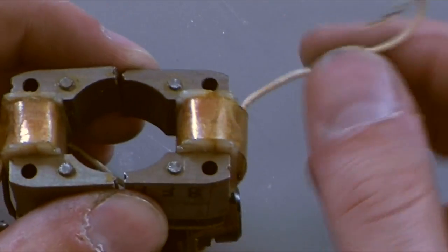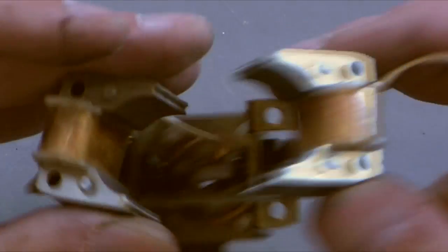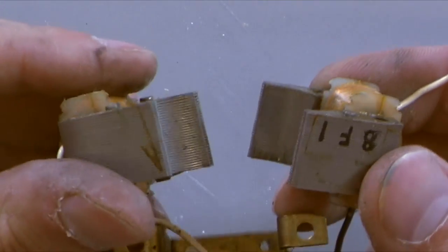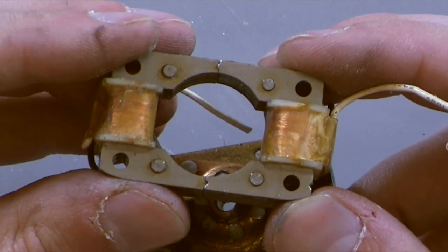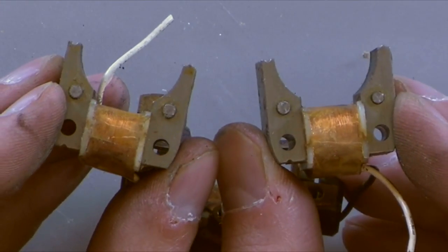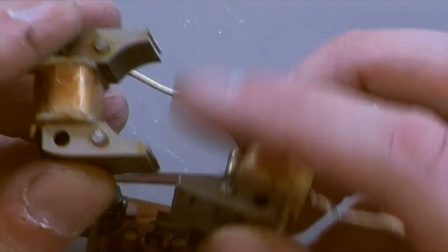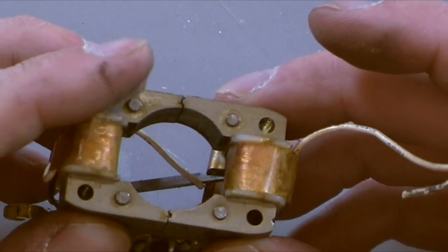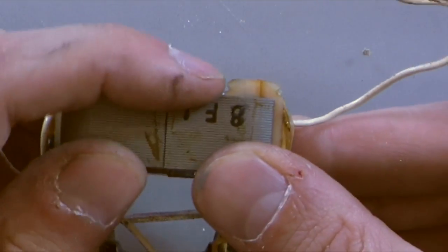Okay. It's just a coil, and it goes out, and these energize this. And you can see it's made up of stacks of laminations, and they're separate, and they hook together with a little notch. They're actually exactly the same, and they just make them on machines, 1 million a day. And you just take 2 and put them like that, and there's a tongue and a groove and a tongue and a groove, and boop, they just fit right together like that. Okay? So you can see the laminations.